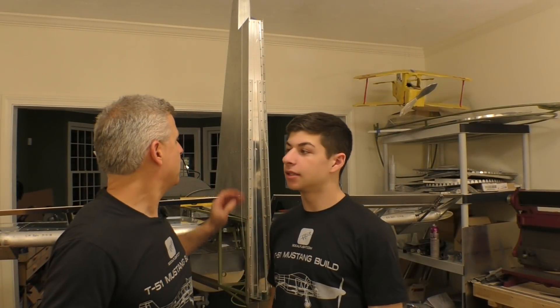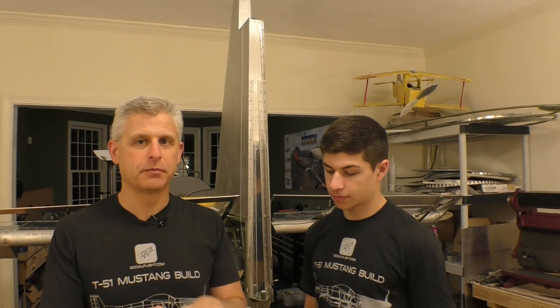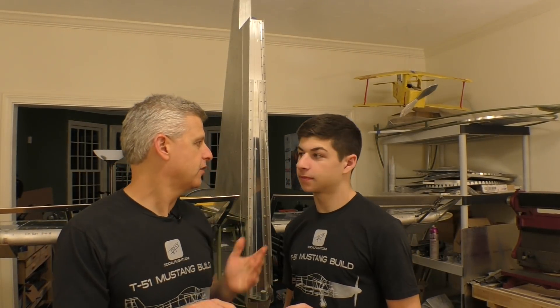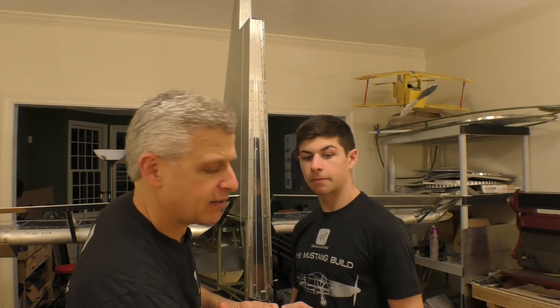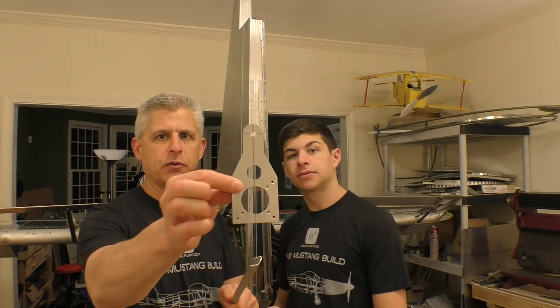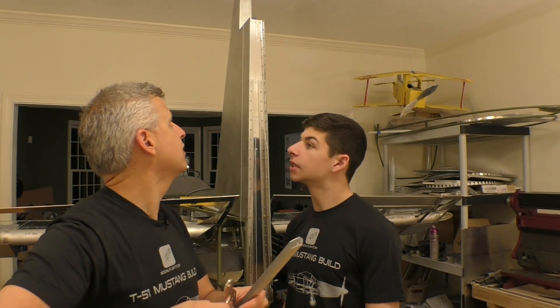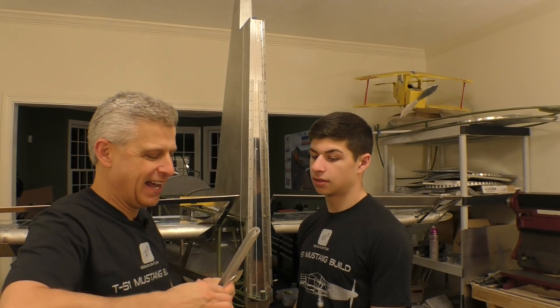It is now time to mount the rudder on the vertical stabilizer. The rudder comes as this huge completed assembly, and part of making it fit is to do the top two hinges. That's what Jake and I are going to work on right now. The bottom hinge is already installed, and there are basically two things that hold the top of the rudder in place. It has this plate, which is the same kind of hinge plate used on the elevator, and that's going to get mounted as the lower upper hinge bracket.